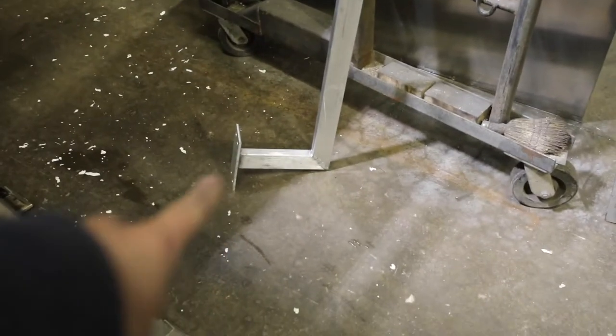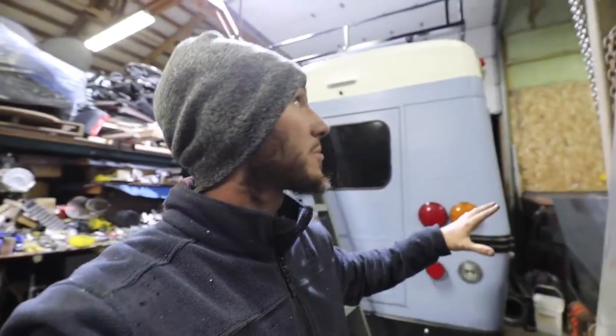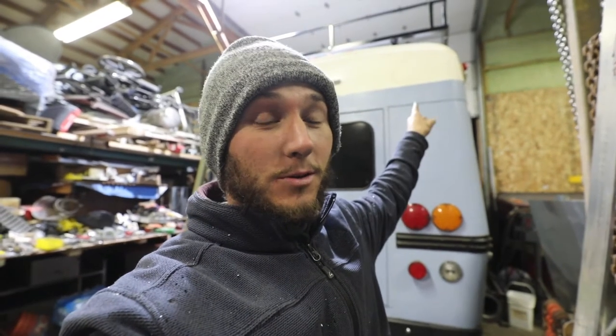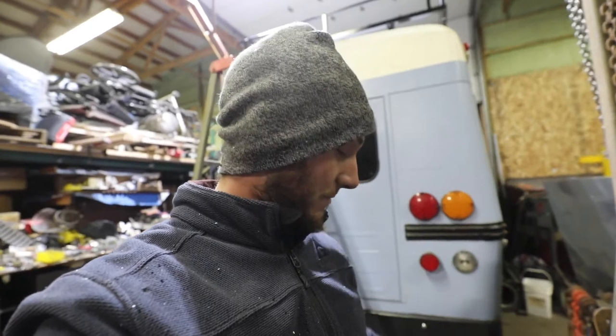All right, so I've welded together that bolt plate, the out, the 86 degree angle, and yeah. Right now that piece just ends blank at the top because I have no way to measure and get the exact right cut on the top end that'll go to the platform. So I think what might work best is to build another one of these, same exact thing, because we need two on each side, and then possibly put in my bottom rung and my top rung so that the whole ladder is in the ladder shape.